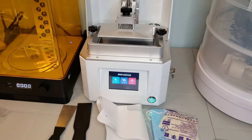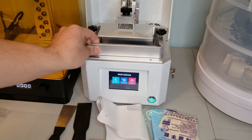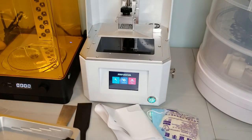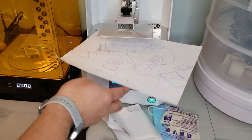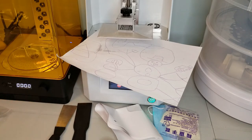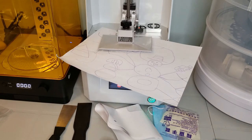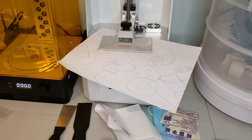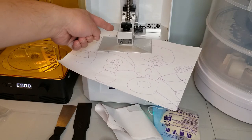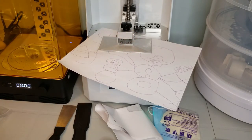The only thing you need to do before starting to print is to confirm the build platform is level. To do that, you'll need a piece of paper — a four-year-old artistic masterpiece is optional, a blank sheet will work as well. Once you have your sheet of paper, you release and take off the resin tray. You put the sheet of paper here flat like this, and then you use the touch screen to move the print bed down to home. When doing that, make sure these adjustment screws are loose so that the platform can actually move. Then you just press firmly down so that it's nice and tight against the film, tighten back up the screws, and you're pretty much good to go.